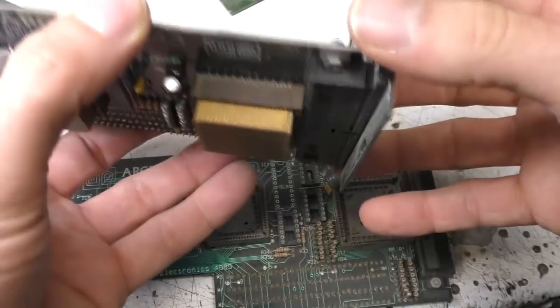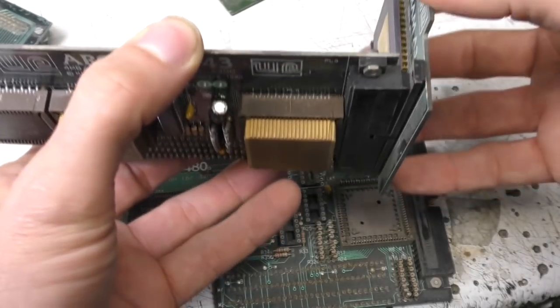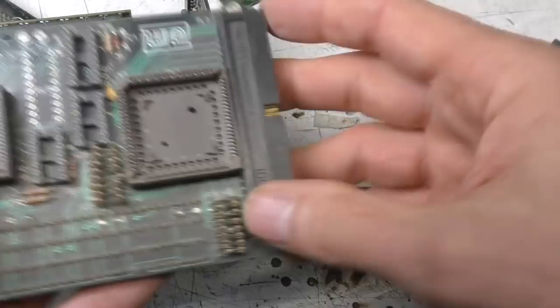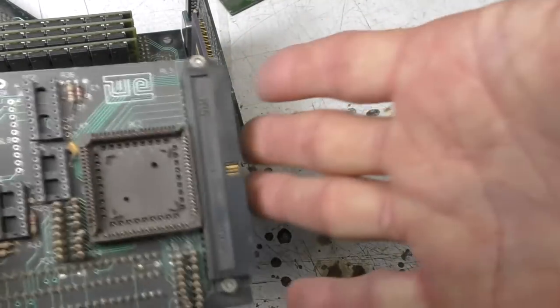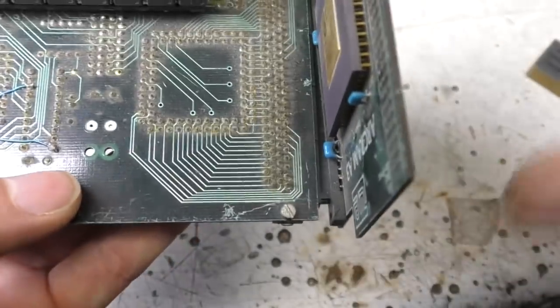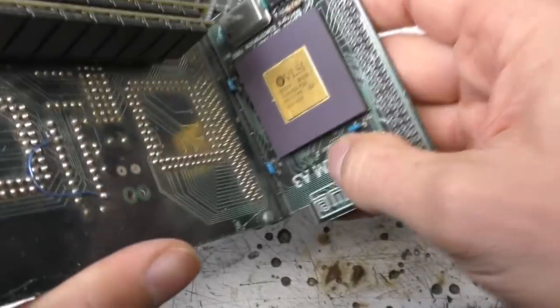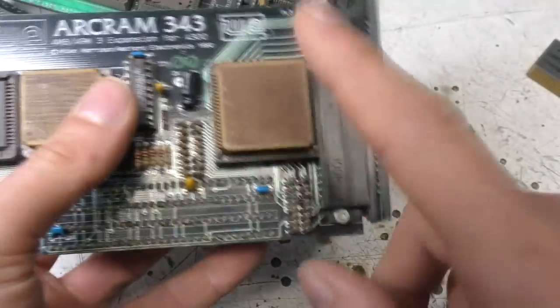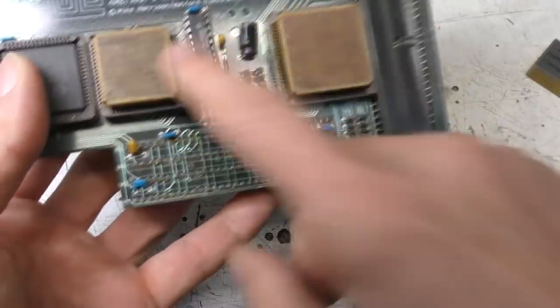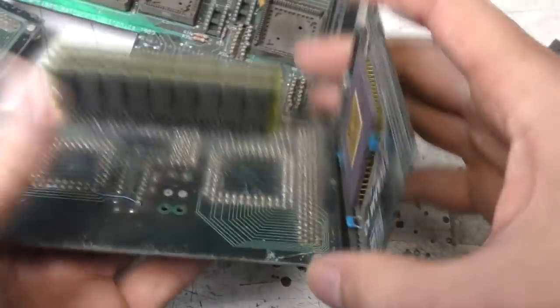But these boards combine the memory upgrade with the processor upgrade. So there's this board that plugs into this connector here, so you could have a simple memory upgrade and just put the original ARM2 processor on a board that plugs into there, or you could have the combined memory and ARM3 upgrade using this ARM3 board. Because it's plugged into the processor socket, this didn't need the cable back to the video controller because we've got the full address and data bus available on here, so this is just a single plug-in board.